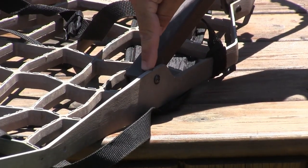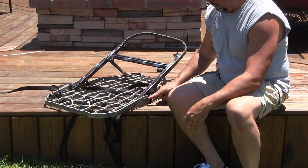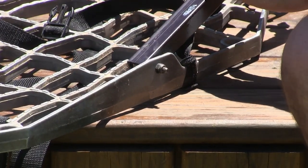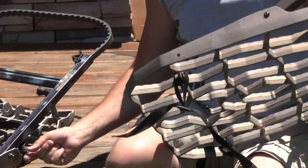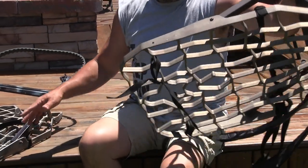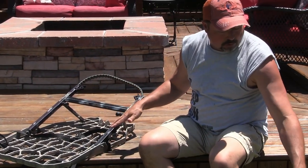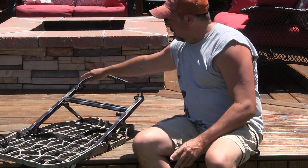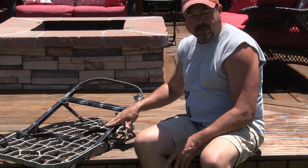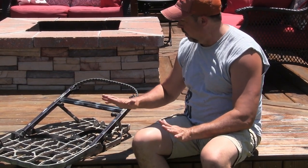This is the way it comes from the factory. The bolt going through that holds this pivoting arm is what's keeping the traction belt from going down. What I did was take it and flip it — it's a very, very simple five-minute fix. When you flip this bolt so it's coming the other way, it's smooth and you're not going to catch on anything. It does stick out a half an inch or so, but I've never caught it on anything. The main important thing is it lets the traction belt go all the way through. We'll show you flipping the bolt — super common sense, super easy, five minutes, two tools — and then these traction belts can go all the way down.